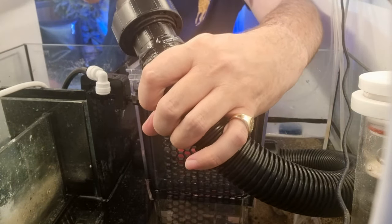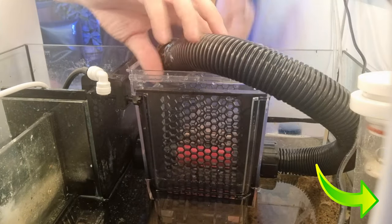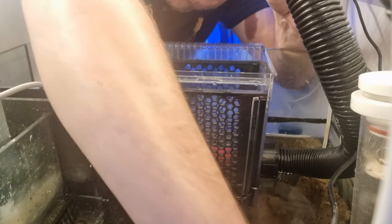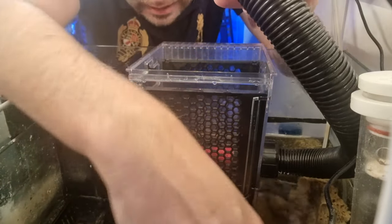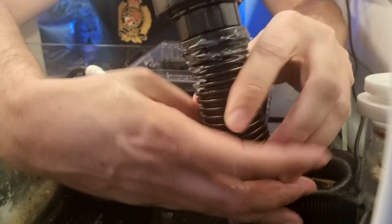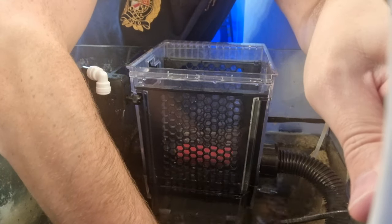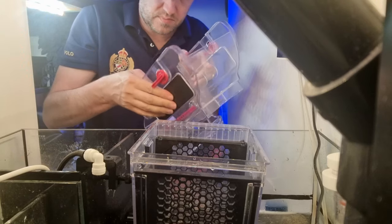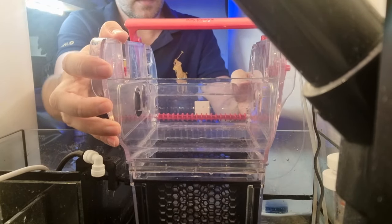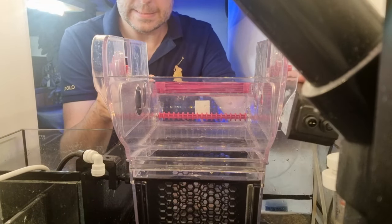The camera here is sitting where my downpipe is. All you need to do — it should be the exact same measurement — you check your dimensions and it just slides over. You push it on; it's a push fit connection, and then the silicone will hold it in place. There are no great plumbing skills required here — you are capable of doing this if you are able to push one pipe over another. Then we need to install the second part, which is the head. This holds the motors and the unused and used fleece — you just snap it on and it clicks in place really easily.